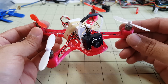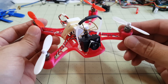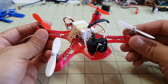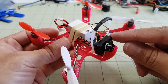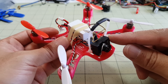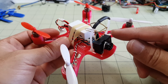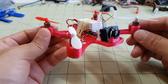I put some flight video at the end of the review and you'll see it flies faster, but not as fast as I had hoped. I think it's because this 3D printed frame is kind of heavy — about 16 grams. The all-in-one camera and VTX is about 4.5 grams, whereas on the budget quad with a separate cloverleaf antenna, video transmitter, and camera, that's close to 12 or 13 grams. But that quad still weighs less overall because this frame is so much heavier.